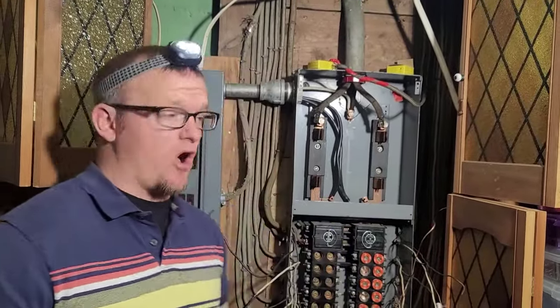This needs to go, especially important if you have a panel where the grounds and neutrals need to be separated. You are going to tape this white all the way up to the neck — current will take any and all paths back to ground, so if this is laying against the back of the can, it could try to get back to the source through the back of the can or through any other metal components. You want this taped up just like a neutral, make sure nothing can come in contact with it, and then terminate it to the neutral bar.